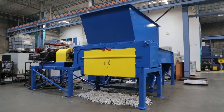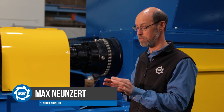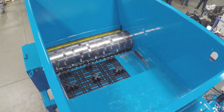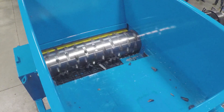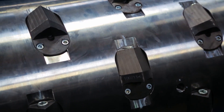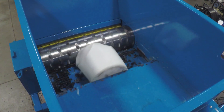The SSI Unishear is part of our family of shredders and it's designed to process material down to maybe an inch to three-quarters of an inch in particle size. It consists of a single rotor — a big kind of a log turning rapidly at about 100 RPM — and it has a whole bunch of little cutters on it. Those little cutters bear against a fixed anvil or a fixed knife, and that is where the machine is doing its chopping.